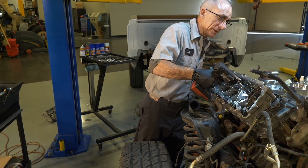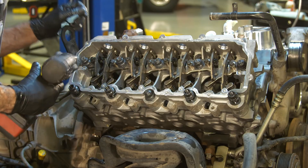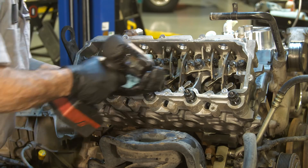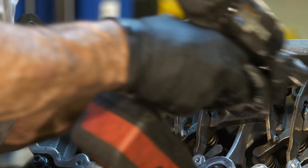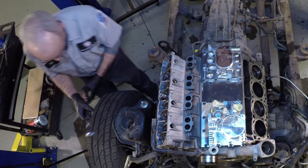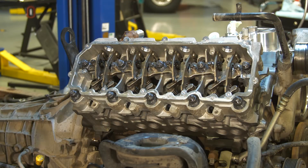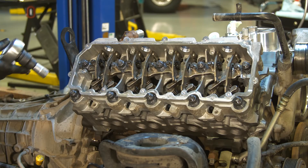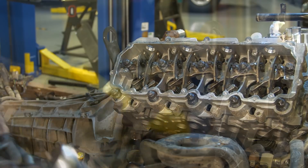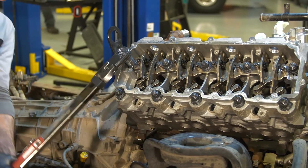I run the nuts down with electric just to get the slack out of everything. At this point it's important to get the top down first because that's where the dowels are, so you want to make sure the dowels are starting, then just take the slack out. If you spin it too fast it'll throw the lube out, so don't get them going too quick. That's just to get it down flush, then the real work begins. There are three steps to torque them — I usually start at 75 pounds. If it pops, it's not giving you a correct torque value; just back it off slightly and torque it right back down. I'm at 150 right now and everything's fine.